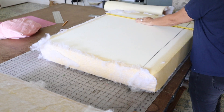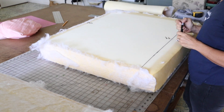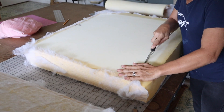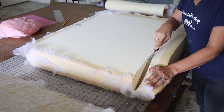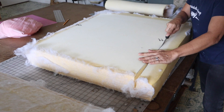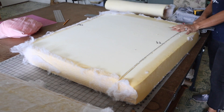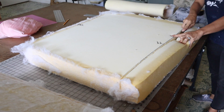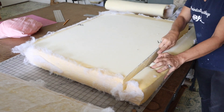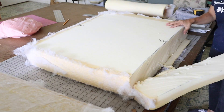I measured 26 inches, marked it, and drew my line. I'm going to get my big bread knife and cut this. If I cut foam all the time, I would definitely get a foam cutter — it's like a jigsaw foam cutter. But since I hardly ever cut foam, I usually order it the size I need. Since I had this foam, it's good to use it. It saves money and it saves petroleum. This stuff is petroleum-based, which is kind of ick. The other good thing about reusing old foam is that the off-gassing of this petroleum-based product is already done because this is probably 20-year-old foam, so I don't have to worry about the off-gassing in my house.